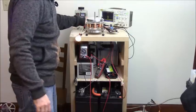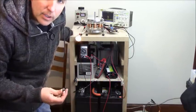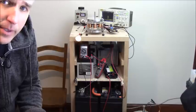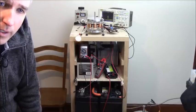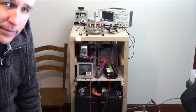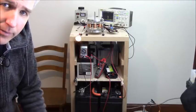So if you're going to try and replace this MOSFET, you should really have an oscilloscope and some kind of clamping mechanism in there that maybe you could switch out, like turn it off. What I was going to do is put a load across the MOSFET so that you would have not just a dead short like a snubber system, but you also have a load being charged. But it's kind of difficult to do that without doing too much, because you can't put a bridge across there, and you can't put a battery directly across there, because then you have a potential that creates a big problem. And I've done that. So you'd have to have a capacitor charging up and dumping, and you'd have to just do it.